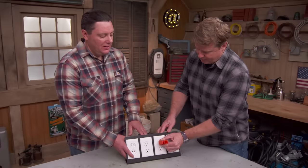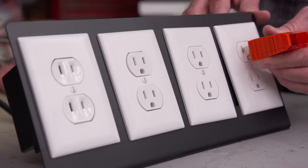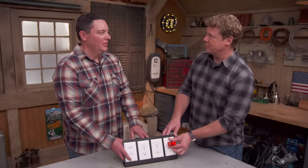If I put this one in and get two lights, that tells me hot and neutral are reversed — the black and white wires are on the wrong terminals. You might think it's working, so why care? Because if you have an appliance plugged in, the on-off switch isn't really turning it on and off anymore. It stops the circuit from being complete, but power is still flowing through the system instead of stopping at the switch. Don't put your knife in the toaster. And then the final one — two lights over here — all good, that's what it should look like.